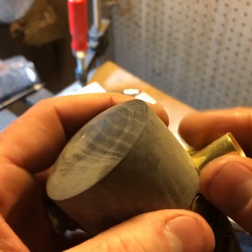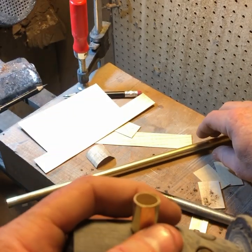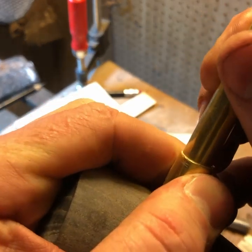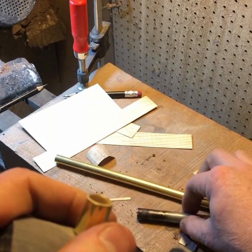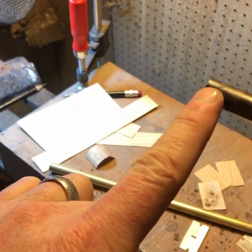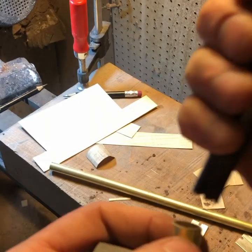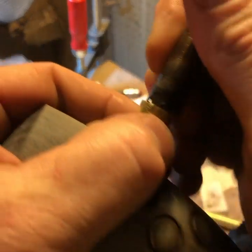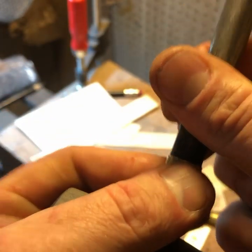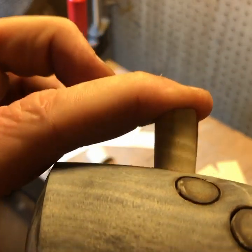Now you have the issue of getting the brass ring off and leaving the veneer inside of it. Usually what I'll do is take a piece of tubing, or you can get a half inch dowel, which I don't have here with me, which is the same diameter as this, and just put it on top and push the brass ring up over it, which I might be able to do with this hole saw here. See if I can pull it off. There we go, just like that. It's actually a lot easier than I thought. And then you can push the veneer the rest of the way in,